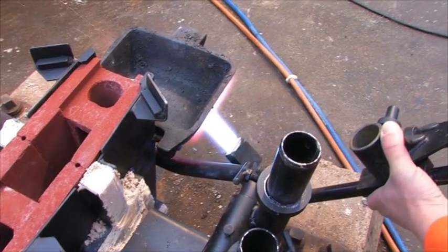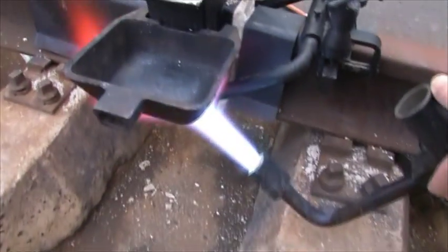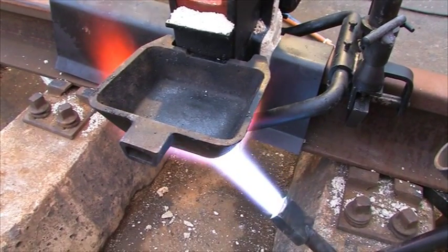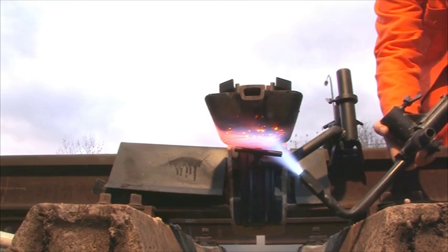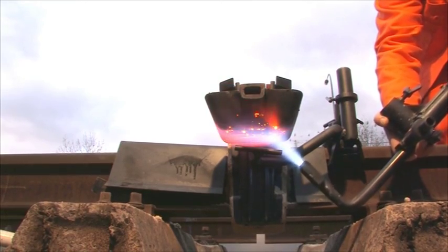Whenever an improper flashback of the flame into the torch happens, the oxygen valve as well as the combustion valve shall quickly be closed. Moist slag pans are to be dried to avoid a dangerous creation of detonating oxyhydrogen gas during the later slag running in.